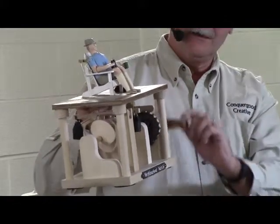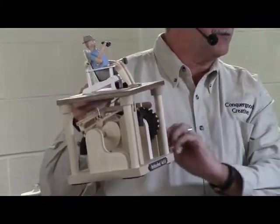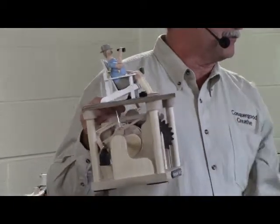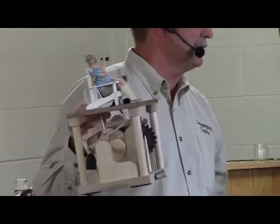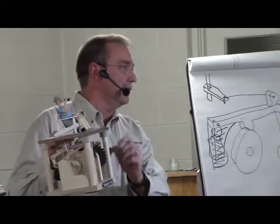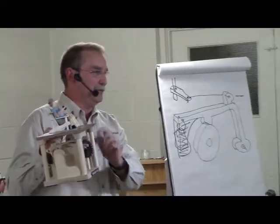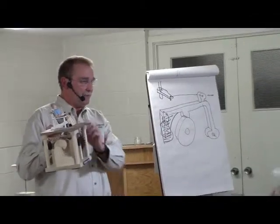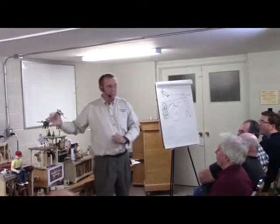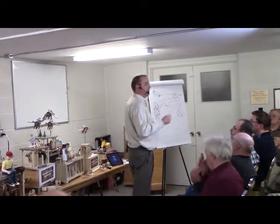Now sometimes I try to build those out of a hardwood or something heavy, but it isn't enough. So I actually cut the bottom off it. I drill out a quarter inch hole. I stick a piece of a broken bolt in or fill it up with solder, glue the wood back in the bottom of it, paint it black, and nobody knows there's a lead weight in there. But it may be necessary to do that depending on how stiff the piece is to make it work. So that's the first rule, it's hard to make a spinning head without doing that.